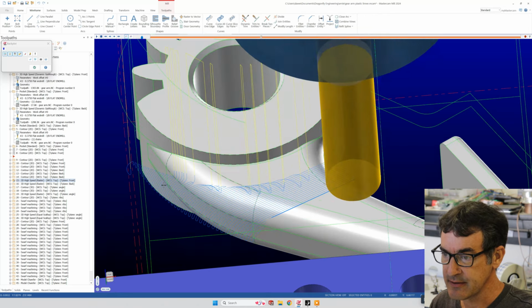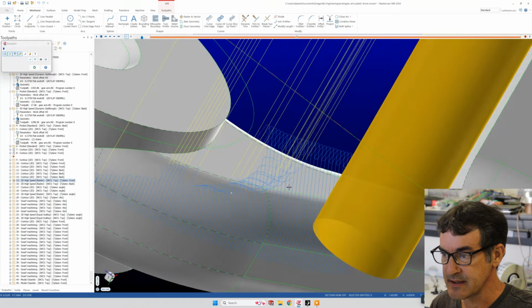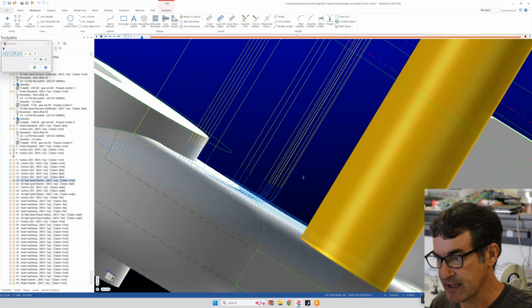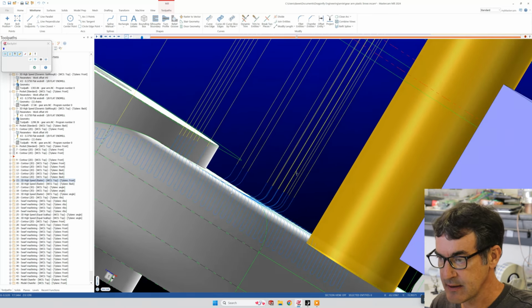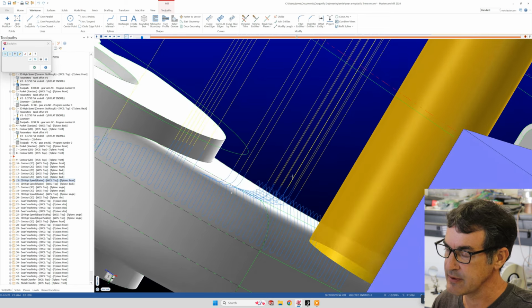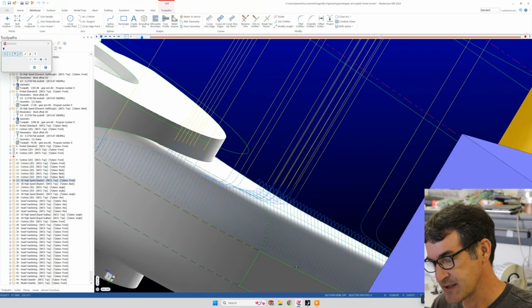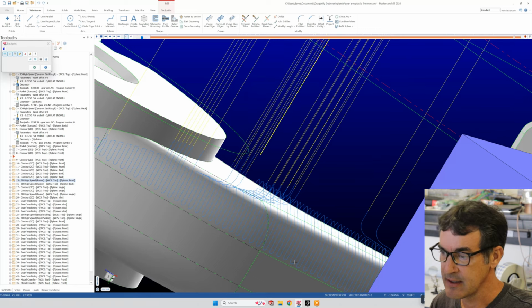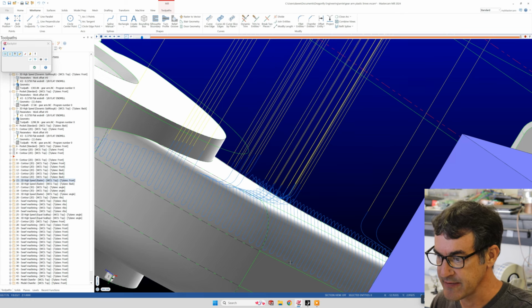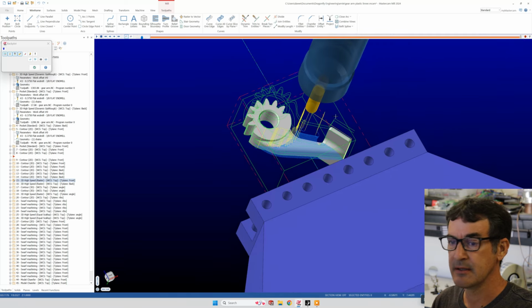And the tool leads out so that you don't have a lead-in or lead-out gouge. That's what this blue arc is right there, which is pretty nice. It just leaves a better finish. You don't get crazy tool flexure gouge marks when the tool enters or exits. It also does a little round transition where older toolpath programs would have a sharp edge, and you get deceleration and acceleration problems, and then funny little defects on the edges of your raster. Anyway, that's the 3D raster operation.